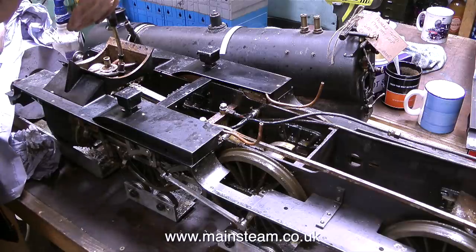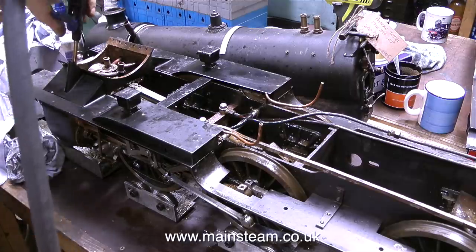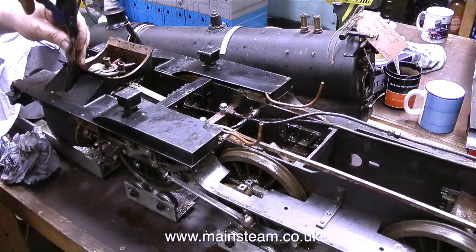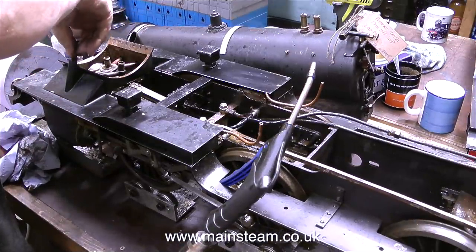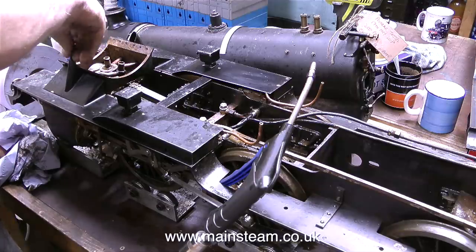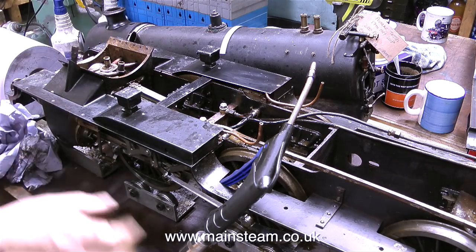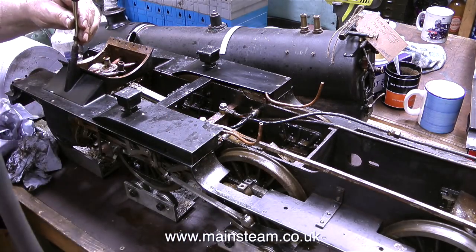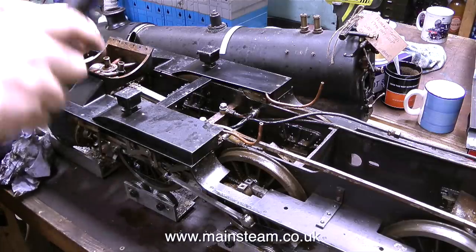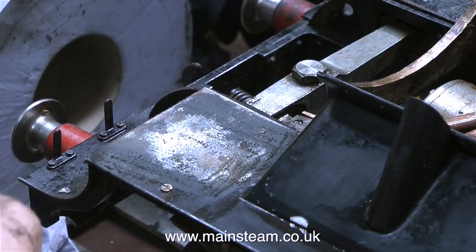I couldn't make any sense out of the engine when I applied air to either side of the feeds to the cylinders. In fact, this one appeared to be just blowing into free air, so there's something wrong. And the other problem, which really is a problem, is that one of these pipes is missing. These are the pipes that go from the super heater to the main cylinders. As I'm screwing this in position, it's not feeling very good — it's very wobbly, and I don't think it should be. You can see by the tissue paper blowing about in the wind there's definitely a problem, and I'll look at that in a moment.